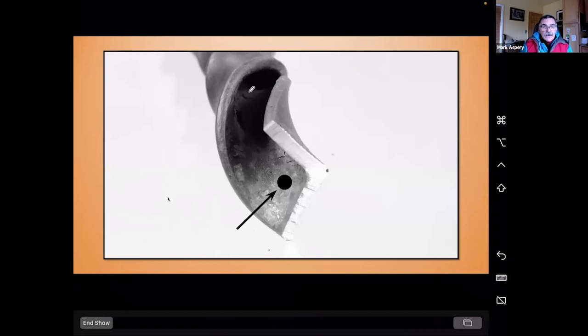And here's the important thing. Most right-handed people tend to twist clockwise. Most left-handed people tend to twist anti-clockwise, counterclockwise. In this case, I want you to avoid your normal tendencies and twist it in the opposite direction. So I'm hoping you can see here that me being right-handed, I have turned this counterclockwise. And the reason I do that is because when I use the gimlet, I will want to turn it clockwise, and this edge is going to be my cutting edge. And you can see if I'd turned that clockwise to start with, it would be going the other way, and I wouldn't be able to use my normal method of twisting it clockwise later on in use. So I want you to turn it opposite to the way that you want to turn it.